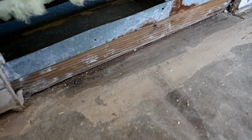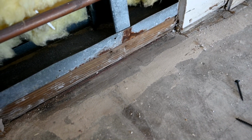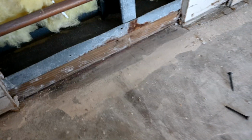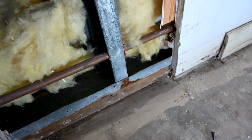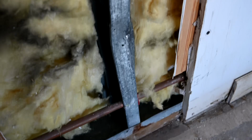And then I've marked on the left side there on the drywall where the bottom plate is. So as long as I'm within 3 inches of the bottom there, I'll hit metal. I prefer to hit the wood. It's a lot easier to screw into the wood than the metal there. So I'm going to shoot for about 1 inch off the floor to run my screws across the bottom. I don't anticipate going across the middle. I might. We'll see how sturdy the drywall piece looks when it's in there.